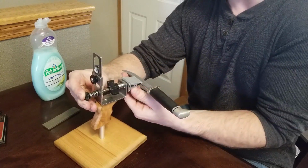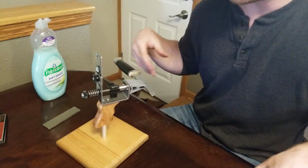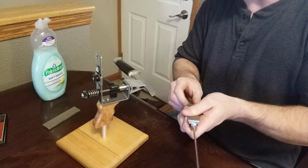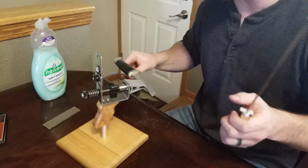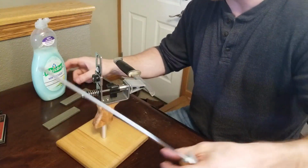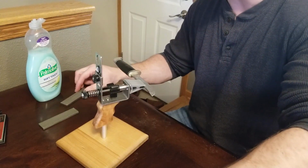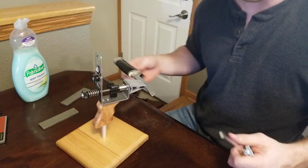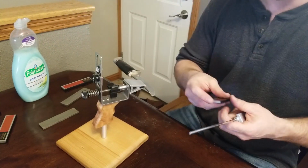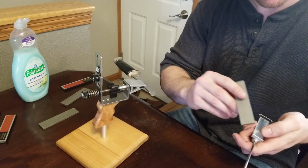I have noticed that there are a couple of flaws, a couple of spots I probably didn't do enough on when I was using the Beast or the 50 grit, because it's almost like a bald spot in the blade, and the whole edge would have needed to be brought back further to accommodate for that flaw in the blade. But it's minor, and I'll just have to remember next time, don't get ahead of myself. I need to watch for stuff like that and make sure 100% that I've got a burr forming all the way across the blade when I'm using that heavy of a grit.